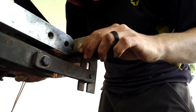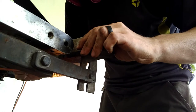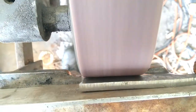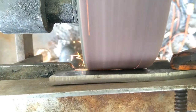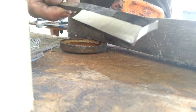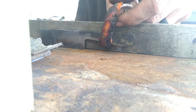I like to start all of my bevels off this way — not everybody does this. This is how I do all of my pre-heat treat grinding, my bevel setting. It's done with a piece of angle iron — I set it in there so I can quickly get that grind done. There's really no point in fussing over making this grind perfect; if it's super bad you'll definitely want to clean it up. This takes a lot of practice and trial and error. Once I get it done I keep it cool, flip it over, clamp it back on the other side, and there you go. Quick and dirty — get it done and move on. For this particular razor, the next step is going to be carving.